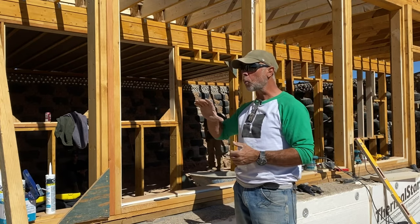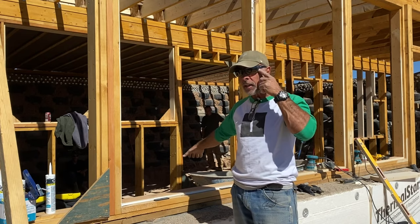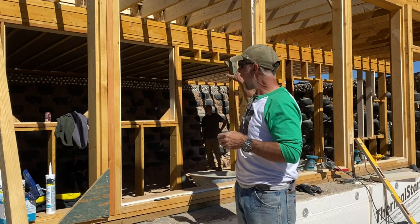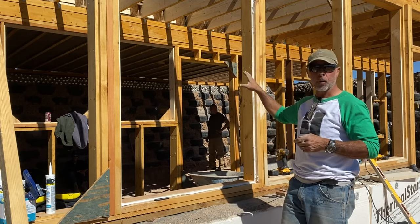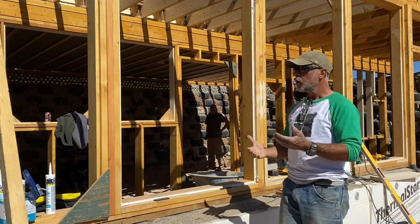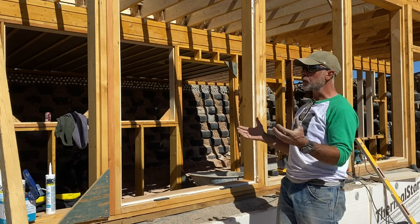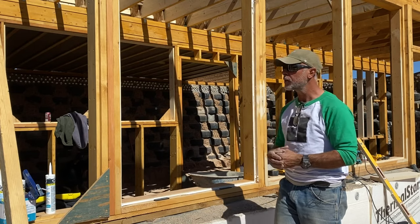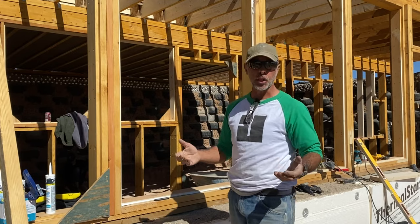So this is going to start warming up the soil, the gray water that's down inside of these cells, and the mass of the building. Not just the tire walls, the adobe, but also the floor. We're getting ready to start charging it back up. It's been charged from the sun when we pounded the tires, but then the cooler weather at night's been reverse charging it into colder weather. So now we're gonna reverse that again to try to make it a livable situation for the winter.